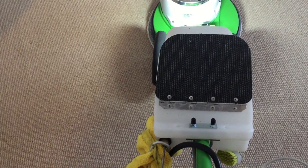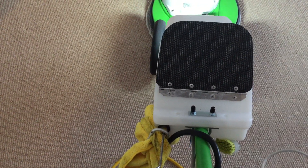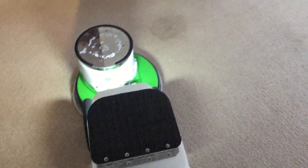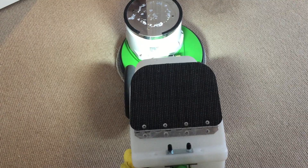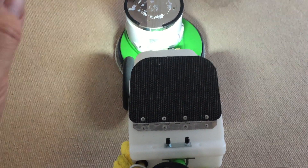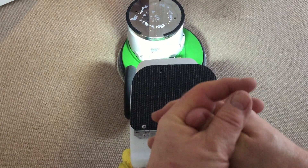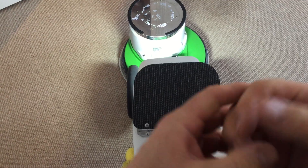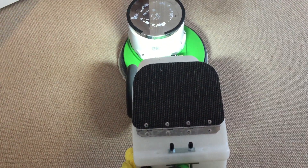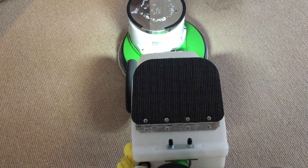I have CLO2 in my solution tank. I'm using the Just Gone product in this case, at 10 ounces per gallon, which is normally where I put it. Overall, the carpet looks fine except for these upchuck stains. It is possible these stains are permanent, because wool is an animal protein — it's a hair — and the bile can actually break down and corrode or almost digest the wool.